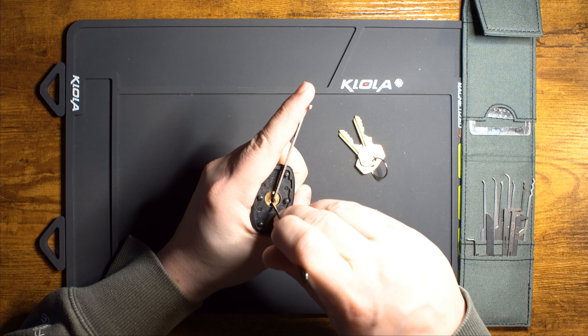That is the entire process. The core is not overly challenging if you have some skill with serrated and spool pins — it's not under heavy spring tension and operates rather smoothly, so pushing on those spool pins with the pick gets the core moving in the right direction. Overall, it's an interesting lock — definitely tough from the physical side, but not the most secure from the actual picking side. Thank you very much for watching. Until next time, take care and I'll catch you later.